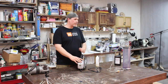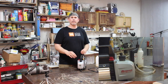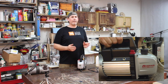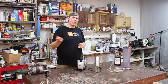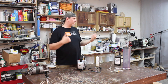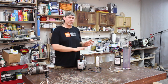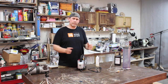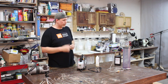One thing to mention: when you hook this up and pull it to full vacuum, you're going to get smoke coming out of the exhaust — what Sean Rubino called a plume of oil smoke. I would recommend not breathing that in and venting it out of the space. Sean runs his outside. I'm in a machine shop anyway where it smells like solvent and oil, so it's not a big problem for me to run it inside. Just be aware of it — it's normal for it to be smoking and smelling like oil from the exhaust.